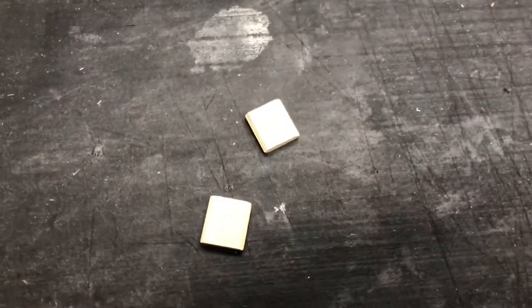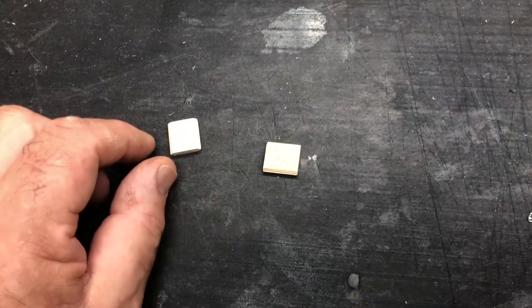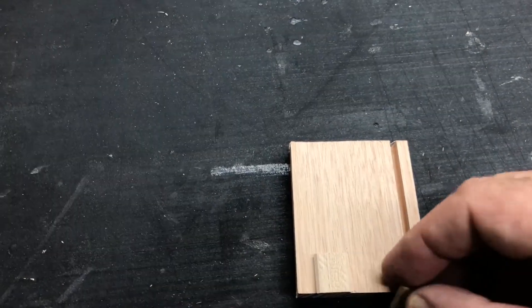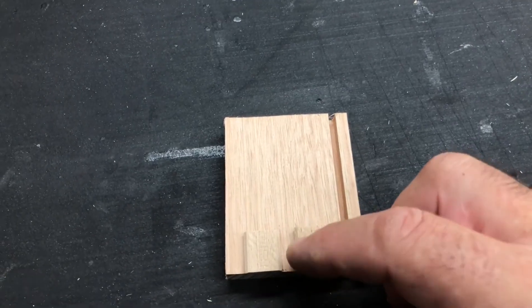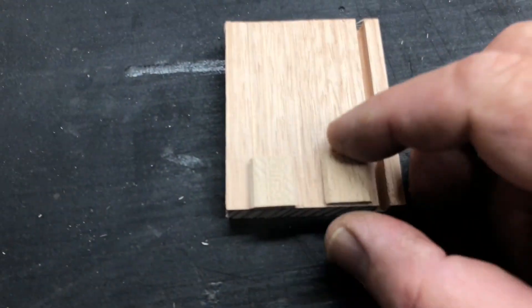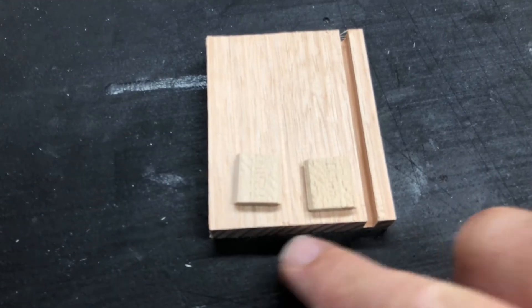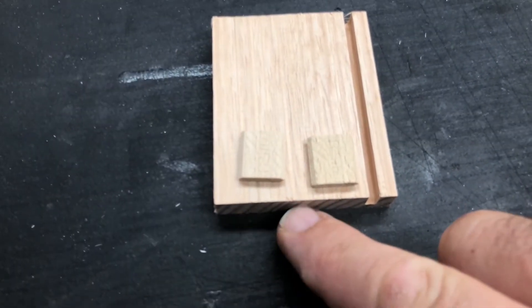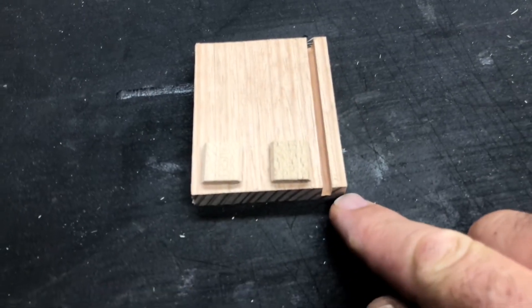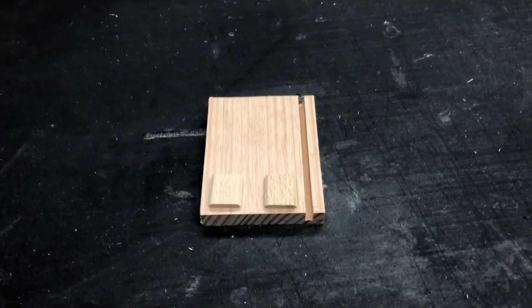It's tricky because the regular paddles on the reference fence of your domino — if you want two of them and you want them roughly about here so you don't go into that groove — the paddle stops at about the center, so you're only going to get one. It's not right in the center, which means it takes a reference from this side or that side depending on how you're doing your dominoes. It's always a bit tricky.